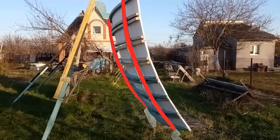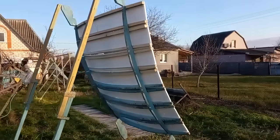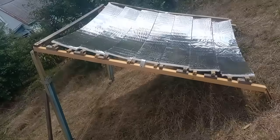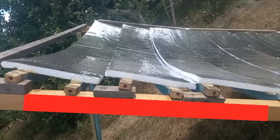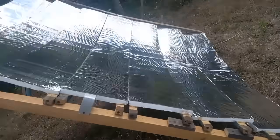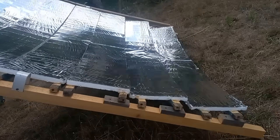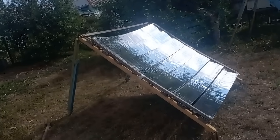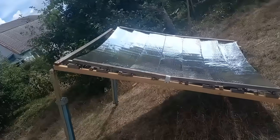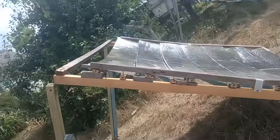You see that these beams are curved, as a result of which their cost can be high, and therefore I experimented with similar straight beams. This is the first option, where half of the ribs of the mirrors lie on this straight beam and the second half of the ribs rest on these parts to give the mirrors the required angles of inclination. These are the two upper beams, which are also straight, and one of their ends is fixed with this metal bracket. This is the second option, where those ribs rest on these rods which have different heights for the required angles of inclination of the mirrors.